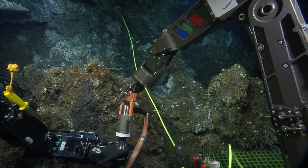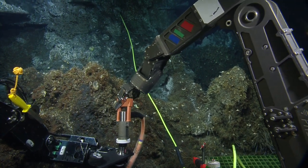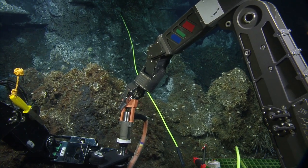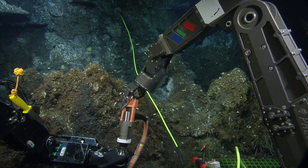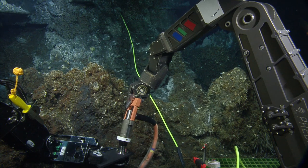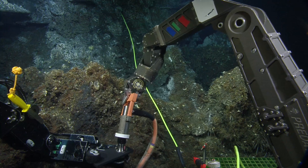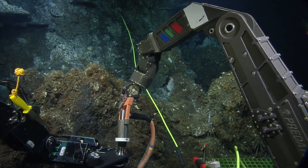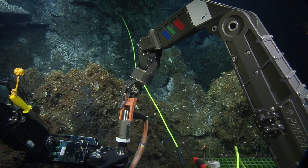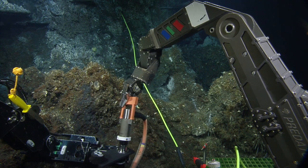Oh, that looks so good. Yeah. Come on, baby. Which way for the key? Clockwise a little? And if you jog your wrist back and forth, it'll line the key up while you push down, but it's tough, but you just kind of got to do a little bit of this as you push. Oh, that's good. Come on, baby. Get on there. Where's the damn key? You got it. And then you go back the other way. Yeah, just like that. And you keep pushing down as you're doing that. Back and forth, back and forth. The key's somewhere around there.